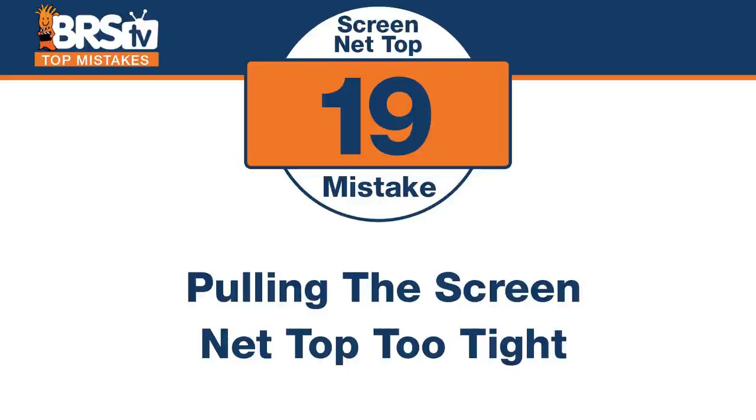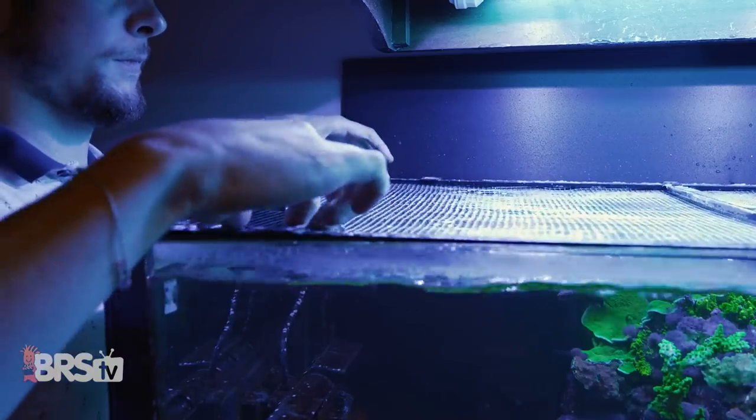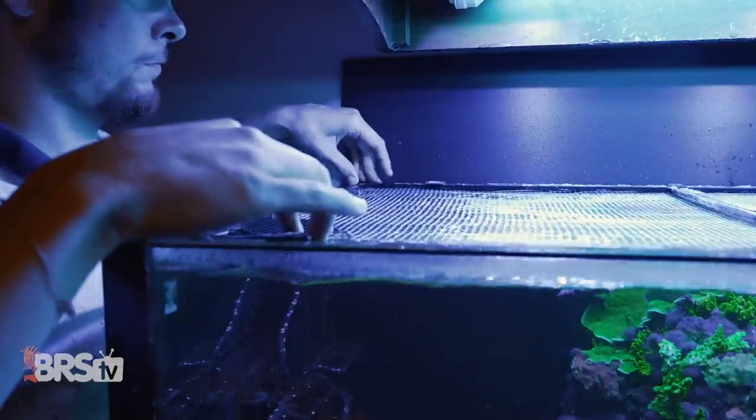Number nineteen — I've made this mistake early on but don't do it anymore. The mistake is pulling the screen net top too tight. One of the telltale signs is that the screen flops constantly and doesn't sit flush, because across the diagonal it's so tight that you're bending the frame and can't get it to sit flat. When you do it too tight, you also run the risk of popping out the spline because it's under so much tension. There's a lot of desire to make it taut so it looks really clean, and we talked about that heat gun trick, but if you make it too tight — like two friends holding it down as tight as they can — it's actually going to produce a worse result.